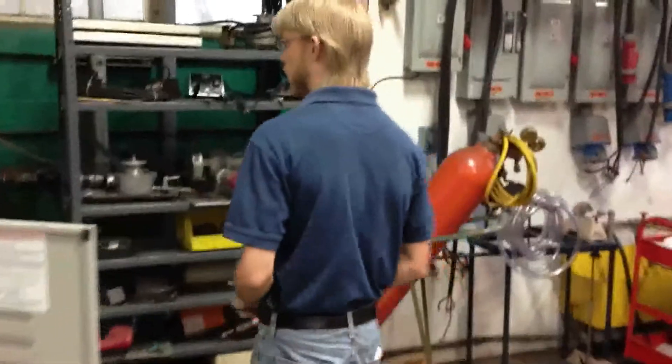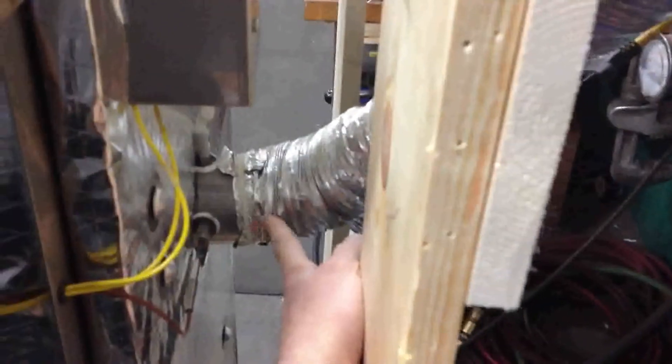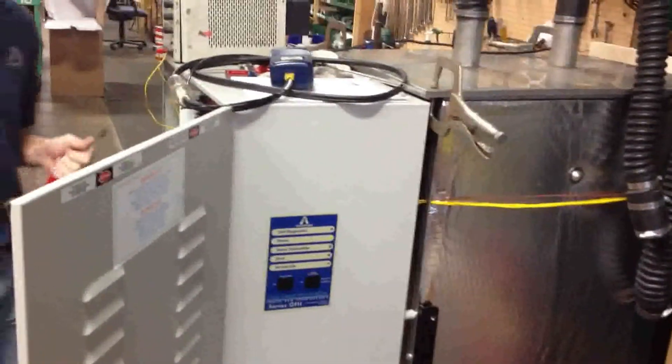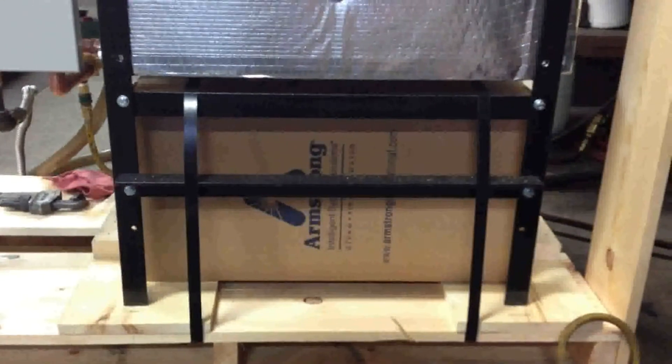We'll come back around. It's going to be kind of hard to see since this is on a test table, but for a 150, the flue piping comes right through the back. Back here is also your pressure switch for the flue. And your steam dispersion will come out the top. Also, this unit ships with ionic beds — they're typically shipped loose underneath in the box. You want to make sure you get those installed before you fire the unit up.